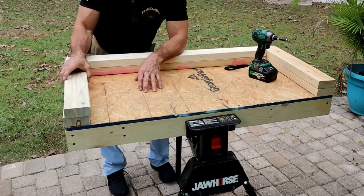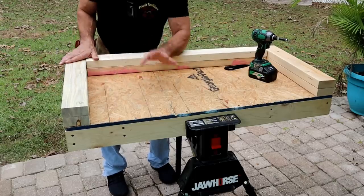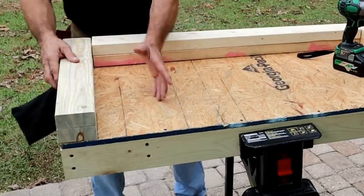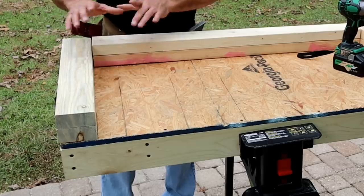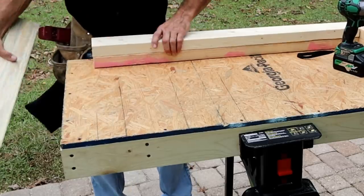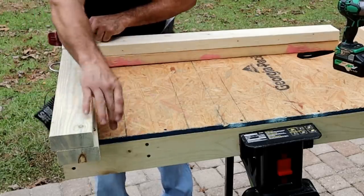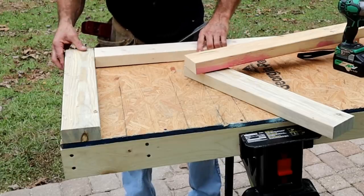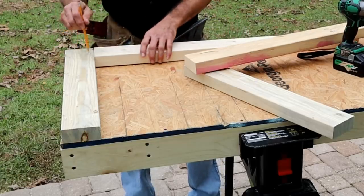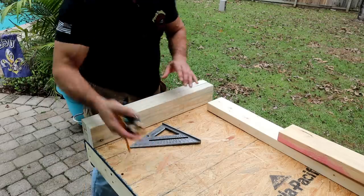These are your base and top plates. You're going to have two top plates, but I'm not going to touch on the second one right now because the second top plate goes over and will lock these in — we'll touch on that later. These two plates right here have to line up with each other when we lay out our studs. It depends on which way you lay it out; you could let one run long and cut the other short to run in between the two ends.